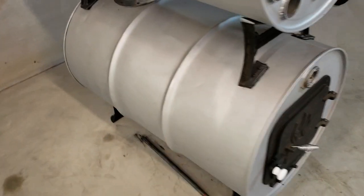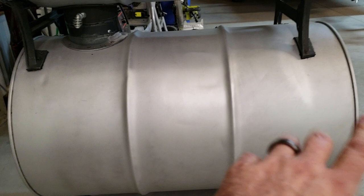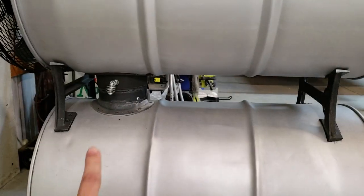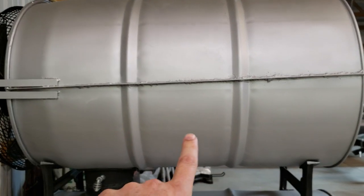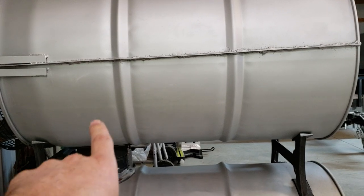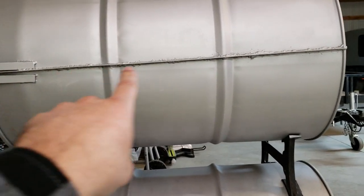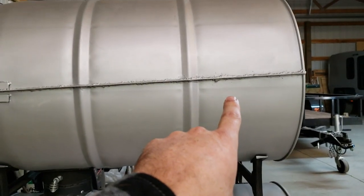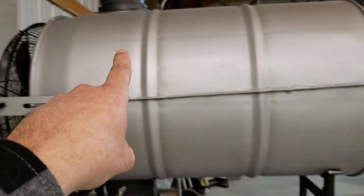What I did is a double barrel stove, as you can see. All the heat is in the main chamber right here. It goes up into the first chamber of the upper stove. The smoke goes up into here — I have a plate that covers the entire thing, the barrel was split in half, but I have some holes and the smoke goes up through the holes into the second chamber and then out the stack.